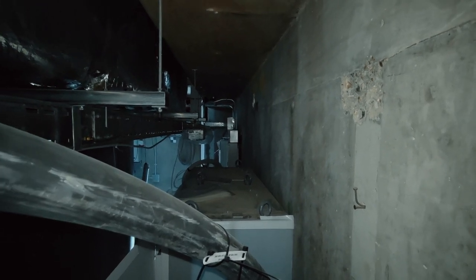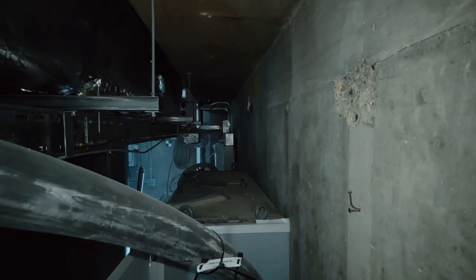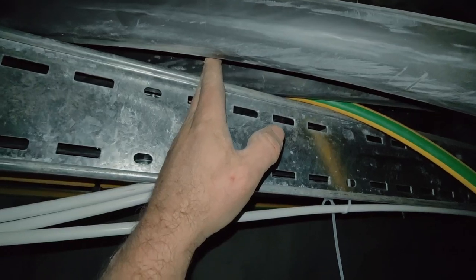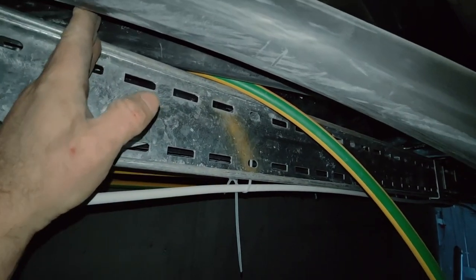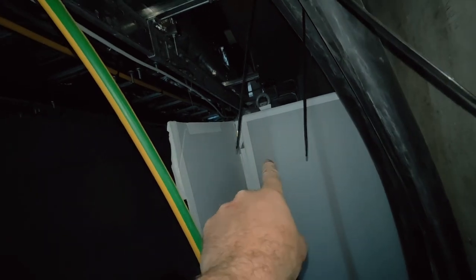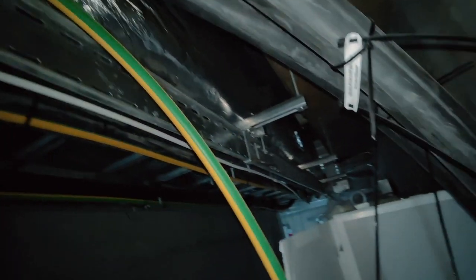I've got to get a measure on both cables, get the glands on them, and then pull them back. And I think because I put the glands on, I'll only get them to there. So I'm hoping, I only need a meter inside, that's the good thing, but I can only pull them back to there, I can't go any further. So I'm hoping that that distance from that panel to there is more than a meter, which I think it is.